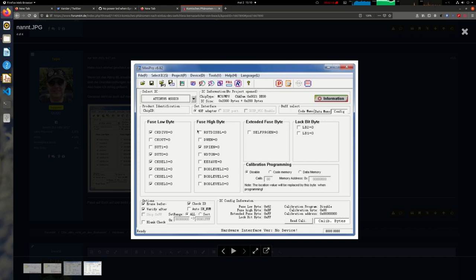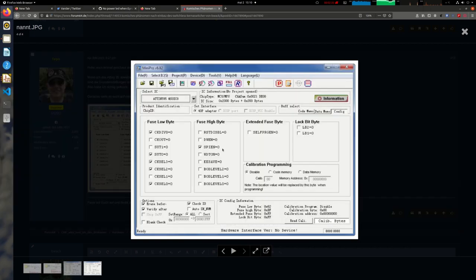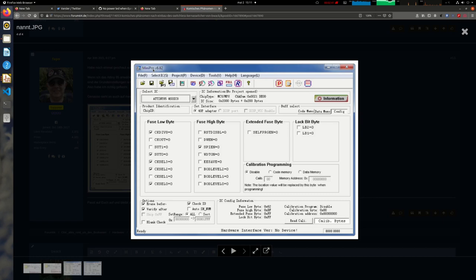That means if you have connected XROM, and the cartridge issues an XROM, then the microcontroller resets, the I/O on the microcontroller on the switcher will change, and if the computer is running from the kernel, it will crash. But the common mistake I think people are making is that when you use Mini Pro in particular, it says reset disable equals zero. So it's like a double negative.